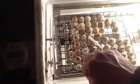Each tray holds about 100 eggs and there are two more underneath. There's an alloy frame connecting all three trays so they all move at the same angle together. They're bolted to the side with plenty of washers so they move freely, and the gearbox from the windscreen wiper drives them, slowly moving everything up and down.